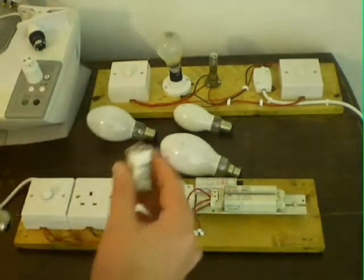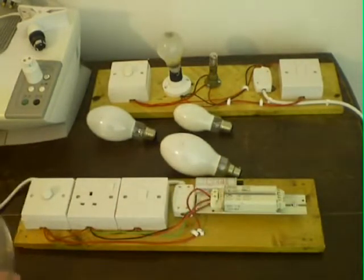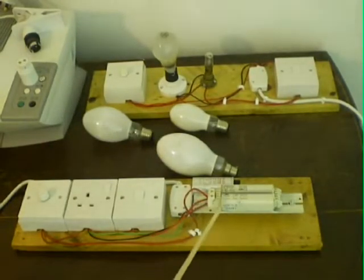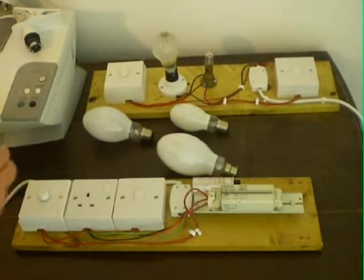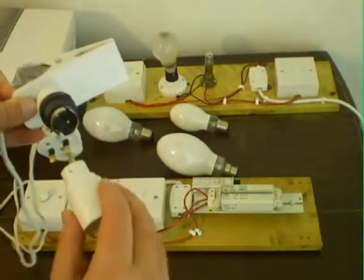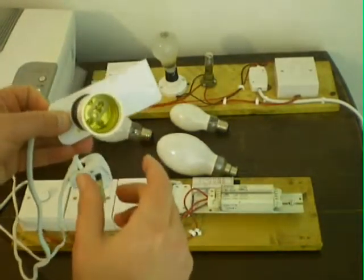These bulbs work similar to that of fluorescent lighting where a starter lamp strikes the tube. The only difference is that the starter lamps are built inside mercury lamps and it is linked to that metal rod — that little black thing. This white thing is a connector block which supplies power to the ballast. To the left is a dimmer switch which is part of this experiment, and to the right is the socket that supplies power to the lamp. Red is for live positive, black is the neutral or negative, and the green is the earth — or in America it is known as the ground wire. This is my E27 base adapter for the mercury lamp. These bayonet lamp holders are more popular in England and Australia, and it is just more convenient for me to use these lamp adapters rather than to keep changing lamp holders.